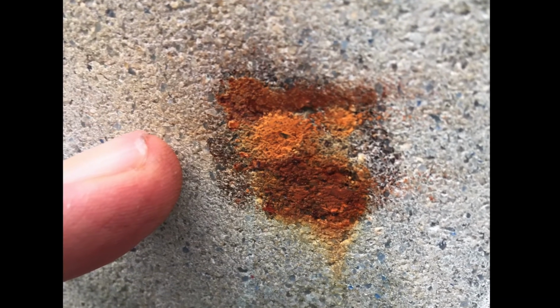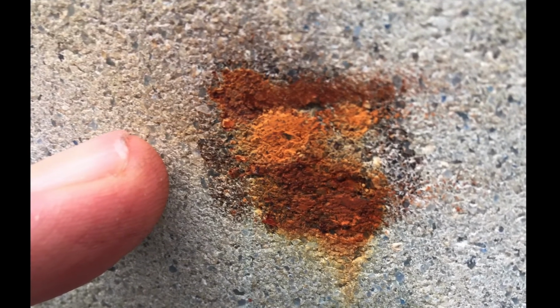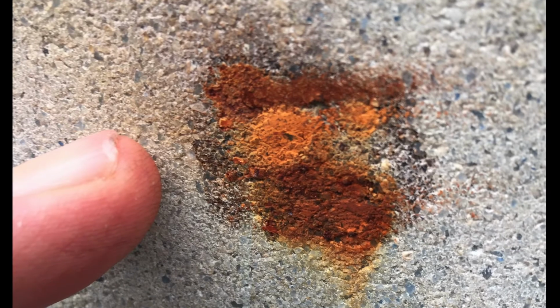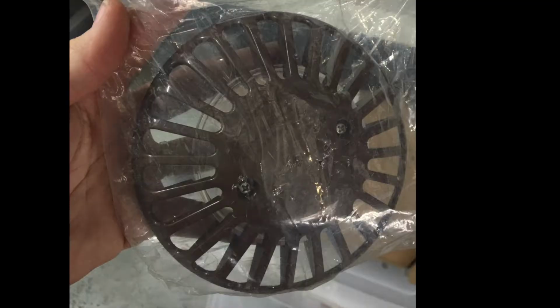And then I used silicone sealer. You can try an epoxy if you can get it to sit in there, but normally you don't want to make a mess and run it all down the wall. Just use silicone sealer to seal it up as best as we could. And then I got a drain cover, or a suction cover actually, and just fitted it over the top, so that so far as the users and everyone was concerned, it was just another fitting in the pool and it was no longer standing out and no longer visible.